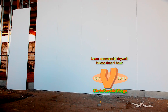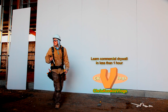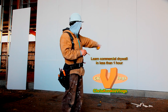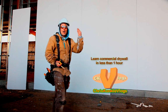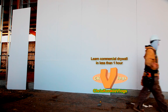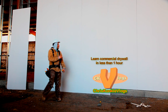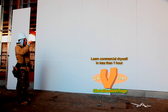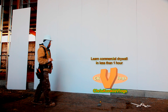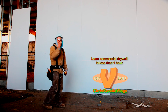Garbage in a nice neat pile. So this one, I'm gonna cut the two small ends off one sheet. What's important is to make sure the bevel factory end is at the top, and the bevel's on the right side. First, it's an angle cut. So I got 20 at the bottom and 19 3/4 at the top. It's important I stayed a quarter inch away from all of the steel. That's just good practice. You cut it too tight, like an 1/8 or 1/16, you're gonna fight with it to get things in. Just always keep it a quarter inch off.